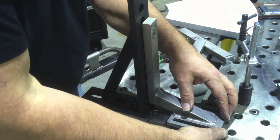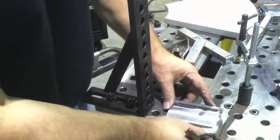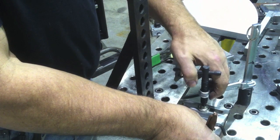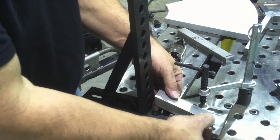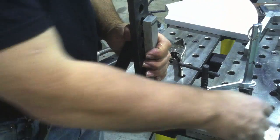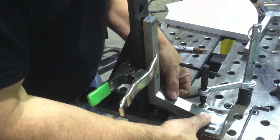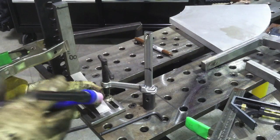I marked out an old line I was using with a different piece of tooling so I don't mistakenly use that. I'm gonna get a quick Sharpie mark there just to know whereabouts to position the flat flange plate. It's about a three-eighths-thick stainless steel plate. You can see how the clamps work — any hole accepts one of these one-hand clamps. Pony clamps are something you can hardly have too many of; spring clamps like these are quick and sometimes you just want to hold something temporarily. I probably got ten of those things at least laying around.